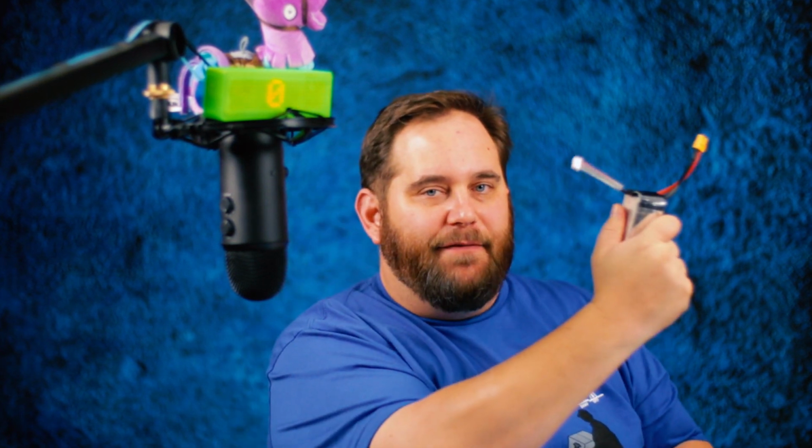And like I said, the fact that it doesn't have a balance tap on the unit to plug the battery into is sort of irrelevant because your quad doesn't have that. Your quad would have discharged the battery the same. The point of this is you have a charged battery that you wanted to fly but didn't, so you've got to take the power out. If you flew it, you would have done the exact same damage that the discharger would do to it.